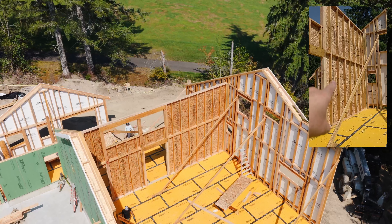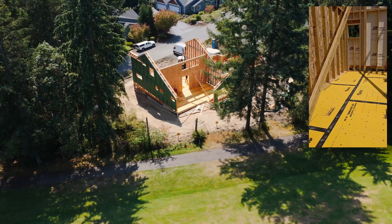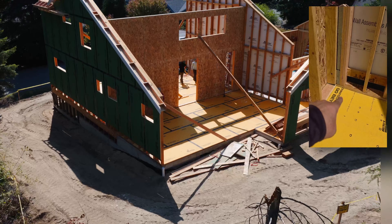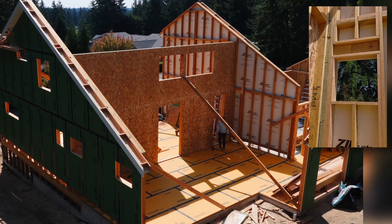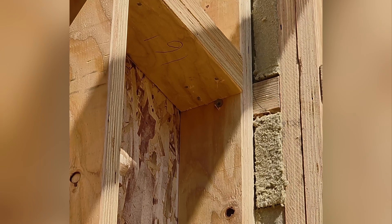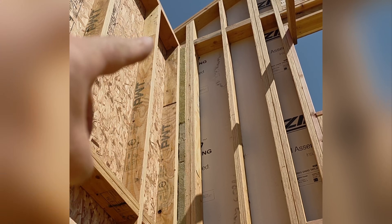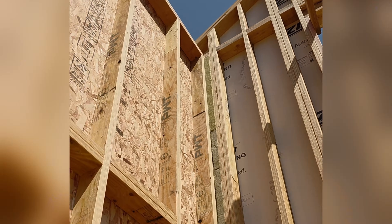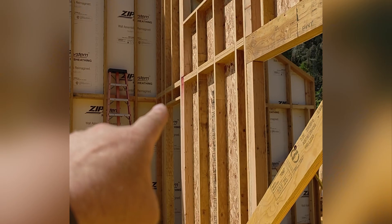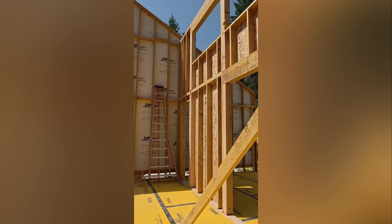Let me tell you something about the PWT — this is why it's so good to use this stuff selectively. If you've followed us for any length of time, you know that we will screw it down to the floor here. We'll measure out four inches and laser plumb dot all the way up. So right here, there's the screw that was installed just really quickly to get a brace. We plumbed it to there, then when we climbed up there, it was dead on the money because that guy is straight. Fasten it there, four inches parallel — when we measure at the top, it's dead on the money because the studs don't curl. They're just nice and straight.